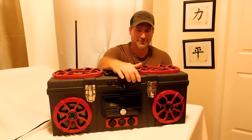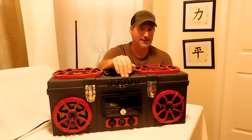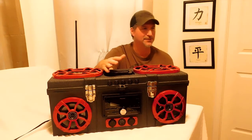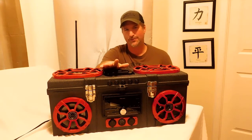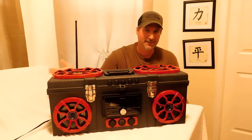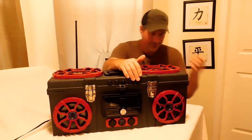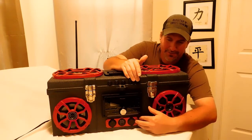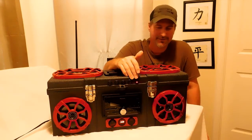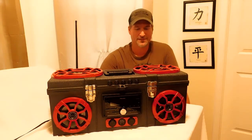The fourth switch turns on the fan. I wired the fan directly to just the batteries to eliminate noise going to the radio, and it helped a little bit, but the noise filter is helping out. I've got two batteries, a total of 18 amp hours — that fan could run for a week and it wouldn't drain the battery. The last switch controls the USB port, the 12-volt socket, and the voltage gauge. You can turn it on and see the voltage — it just works great.